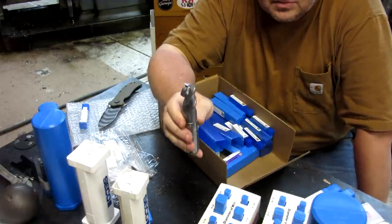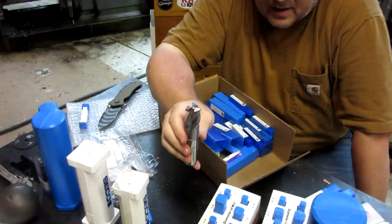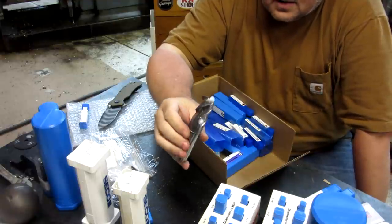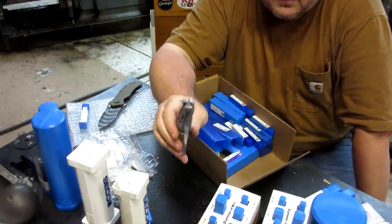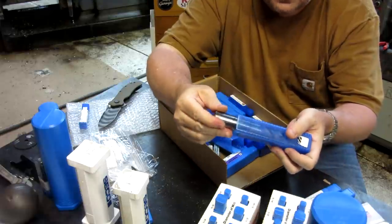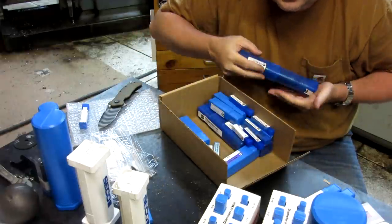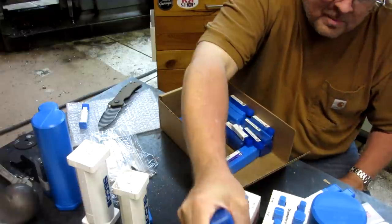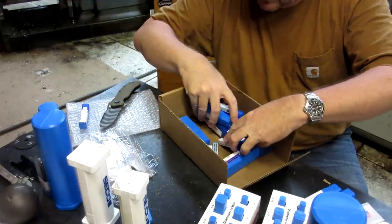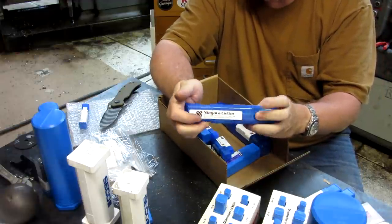Carbide will last you much, much longer and give you much more performance, much more metal removed than a high speed steel cutter or a cobalt cutter of the same configuration. So don't be afraid of investing in carbide, because it will pay you back dividends, I guarantee you. If you're a person that normally spends most of their time working in aluminum or brass or less challenging materials, carbide will last for as long as you will, for the most part. So make the investment. And in this case, obviously, I'm suggesting that you make the investment in Niagara.